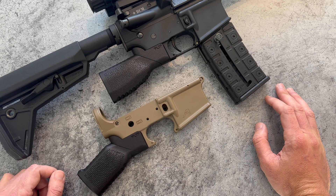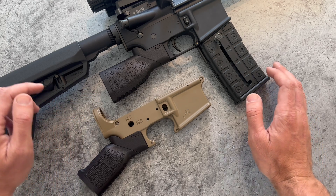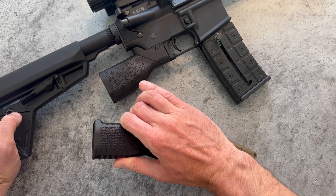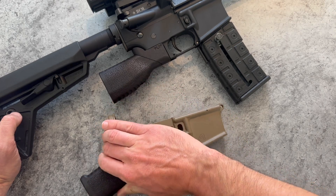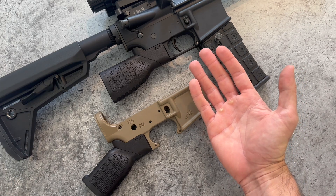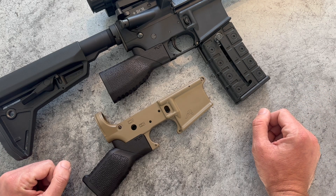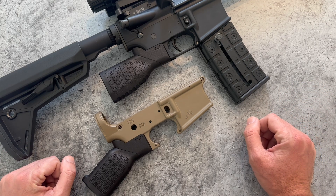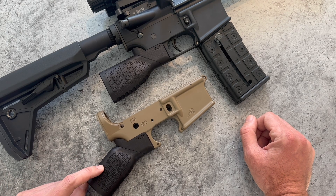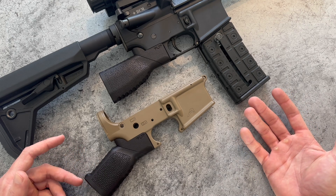Let's talk tech and materials. We're using Jet Fusion technology — cutting-edge additive manufacturing, a far cry from your standard hobbyist 3D printer. This is production-quality reinforced nylon polymer produced on machines that cost about as much as a single-family home. Why not injection molding? Transparently, as a startup trying to build this in the U.S., injection molding is cost-prohibitive at this point and would also add a ton of time to development.